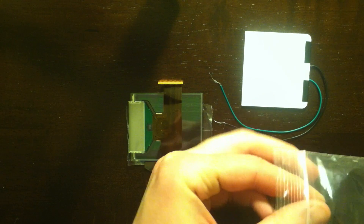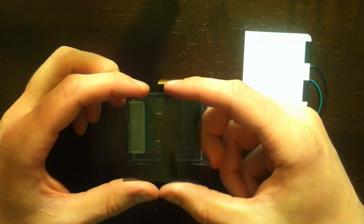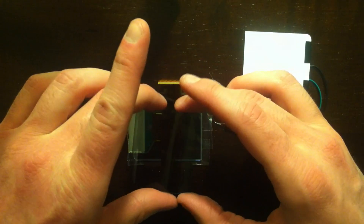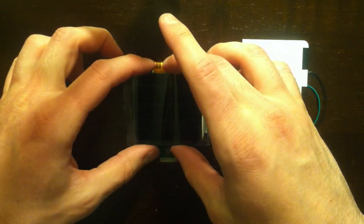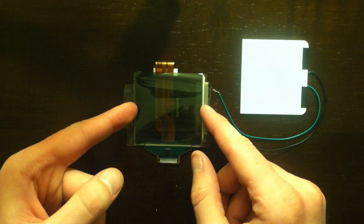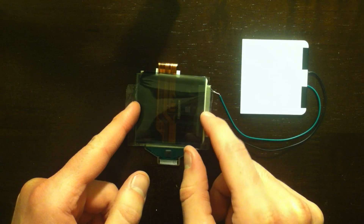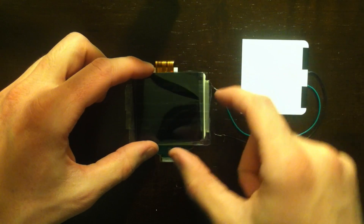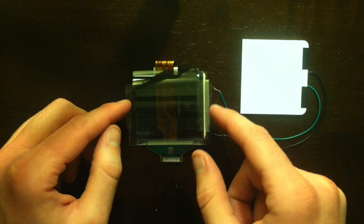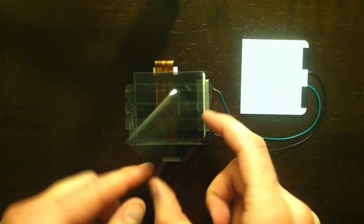Now that that's done, get your backlighting kit. This is your polarization filter — try not to touch the surface because it picks up fingerprints and dust really easily. You do have a couple of options: if you place it normally you'll be able to look through it — it'll look slightly darker but clear. If you rotate it 90 degrees it becomes dark; you can't see through it. If it's tilted 90 degrees the image will be inverted. I'm going to leave it normal this time and slide it in the back.